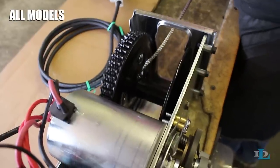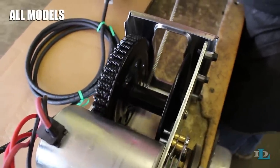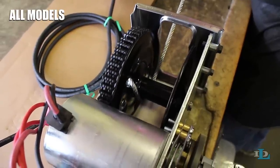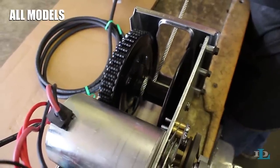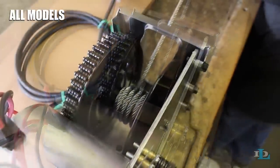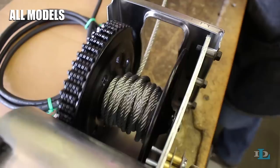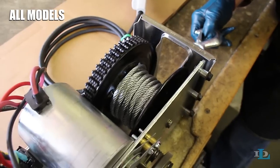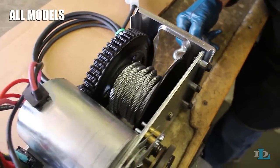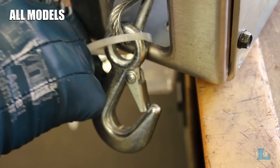Now it is time to install the new cable onto your winch. Remember, you should have just finished reinstalling the winch's cover. We're currently showing a coverless winch just so you can visually see how the cable should look as it's being wound. Connect your winch to power and turn it on to begin winding the new cable. This is a slow process, but be sure to firmly hold and pull back on the cable the entire time. This will help ensure that the cable winds onto the reel in even layers. Once you've wound the entire length of the cable, get a standard zip tie and use it to fasten the cable's hook to the bottom of the winch's base to finish the cable replacement process.